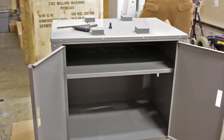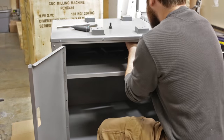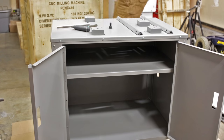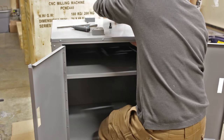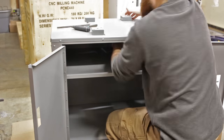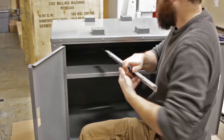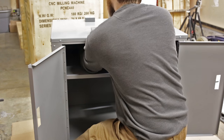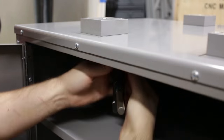The actual mill rests on a really heavy top plate that sits on top of the stand. In addition to that, there are two metal rails that run front to back to help support the top, and four square metal blocks that sit on top of the stand attached with two M12 screws each. That whole assembly is really secured together. The chip tray then has little pucks that align to those metal blocks, and the mill sits on top of that — so it was actually quite sturdy once that top plate went on.